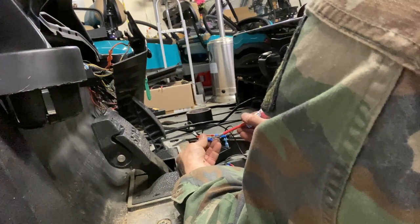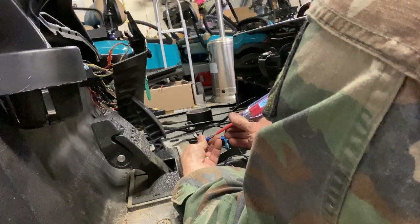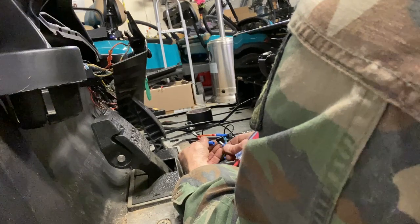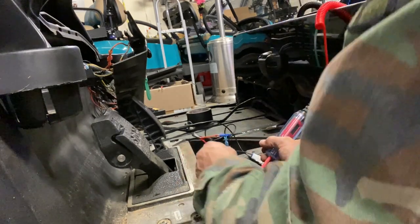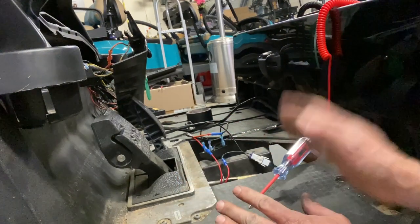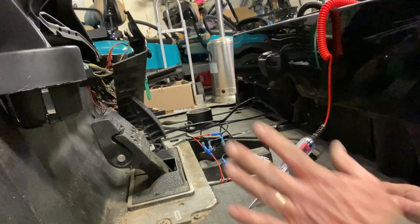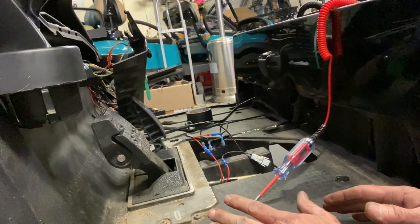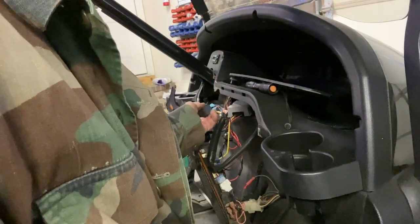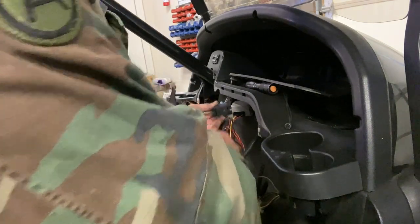So we should pierce into this orange wire underneath your pedal group - that's what needs to feed the brake. And if we wait, it's going to cycle off when the timer goes off - they just cycled off. Now Jim, another test: this red wire - one of the three wires - with the key on, it is hot all the time. So we need to connect the red wire back up to my little circuit breaker. Everything is functional - I need to put everything back together, but everything is functional.